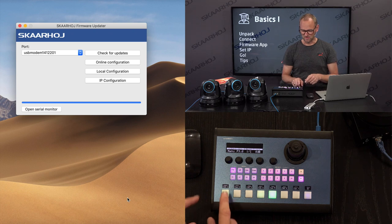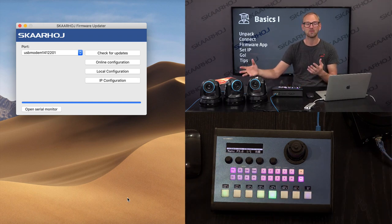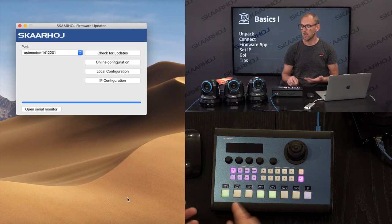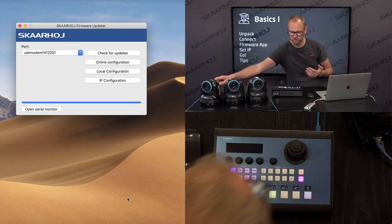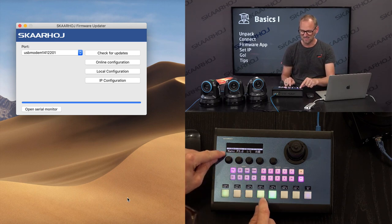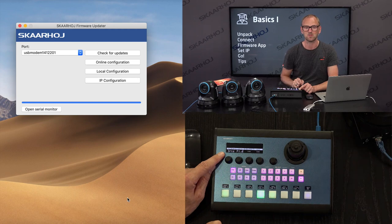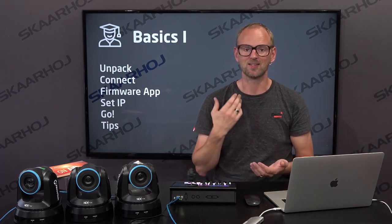I also see something else: when I'm toggling the cameras, the exposure settings are changing because each camera is set up differently. I can see I'm controlling that camera — great. Now I'm controlling camera 4, and if I go to camera 1 I'm controlling this one. We don't have a 2 and a 3; those cameras must have had IP addresses like .213 and .214, since there's a gap. In our controllers we do everything we can to get two-way communication going with the hardware. We ask the camera what its current exposure mode is, instead of just having a dumb knob that forces settings onto the camera. We like to know what is already in there — that is how we define quality in our company.